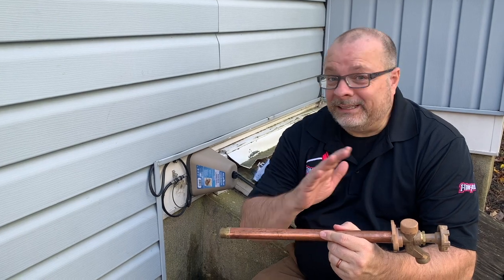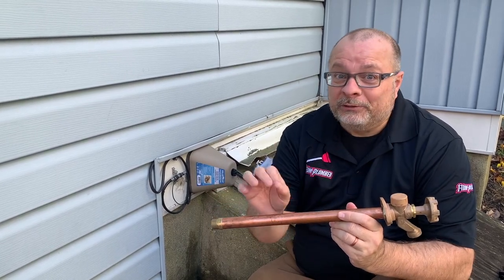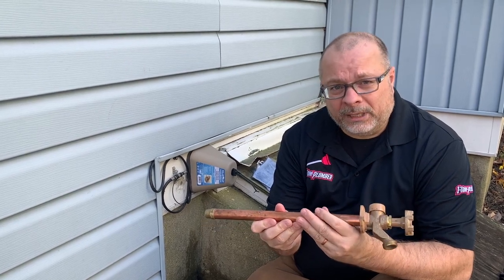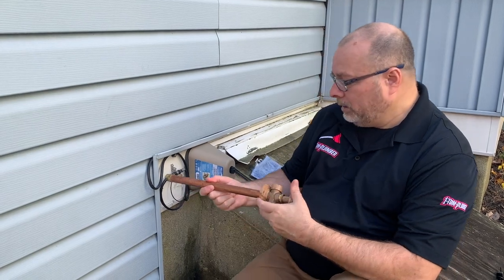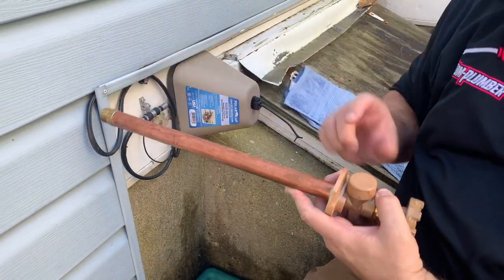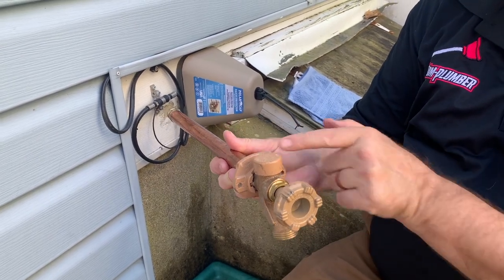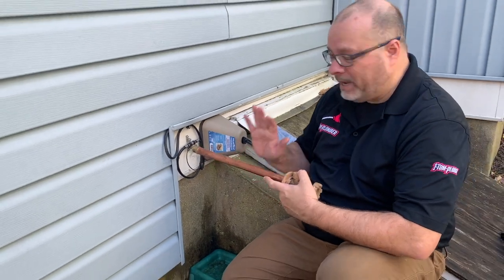Now, if you really want to go the ultimate limit — the best you can do — you want a frost proof faucet, also called a frost free faucet or a freeze proof faucet. This is about 40 bucks or more, but it's a really nice piece of equipment that's going to ensure that your pipes aren't going to freeze and bust and cause water damage. This is a virtual guarantee. You can see there's a long stem — the difference between the spigot and this is that long stem goes all the way inside the wall where it's warmer. It also has an anti-siphon device, which means when you're using your hose in warm temperatures, there's going to be no backsplash into the pipe, so dirty water isn't getting mixed with clean water. This is the best preventative method against freezing and burst pipes.